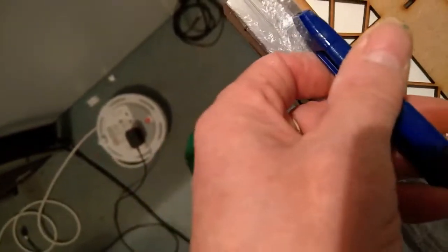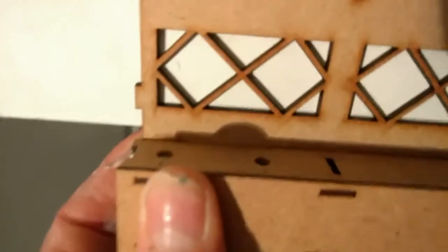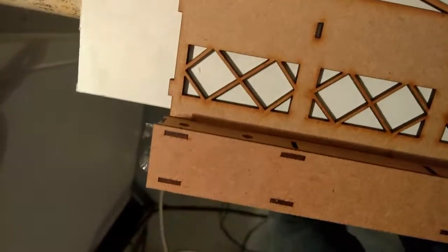And then you have to trim off the cling film using a knife. Maybe best to just run along there with your knife. I can't do this because I've got two hands. Hang on a minute. Right, so just run along there with a knife to take the cling film off, and then using your capping piece, which is now clipped down, we can now go in there and we can use the thin super glue if we wish, because any seep through will go onto the cling film and not end up sticking the aluminium bar in there.